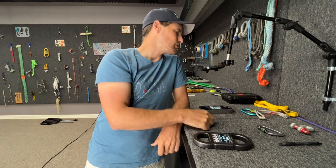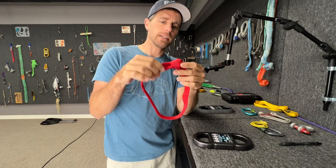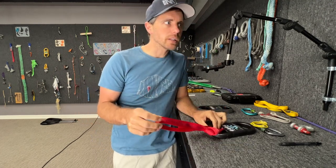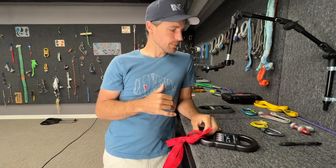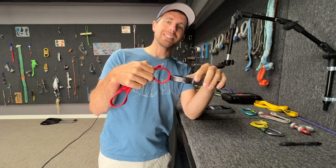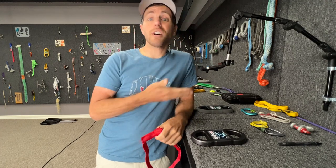You don't really want your fuse breaking at a point where this device is compromised. If you could get a reliable 25 kilonewton fuse, that would be amazing. One inch tubular webbing with a water knot around this thing would break consistently at 25. This soft shackle is a little too strong at 50 kilonewtons. If you're going to clip your life to it, clip it direct. But if you're break testing things that might be stronger than you realize, put a fuse in there. You don't want the fuse in there if your body's attached — the fuse is for protecting the device.